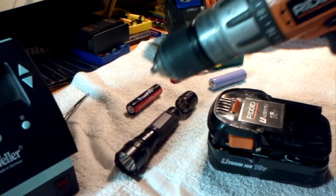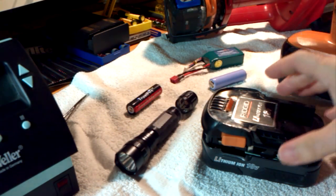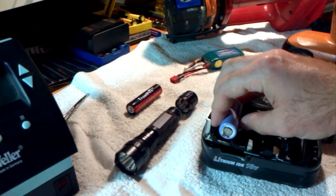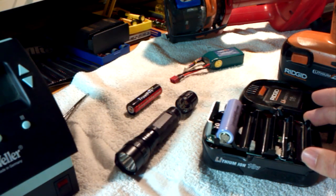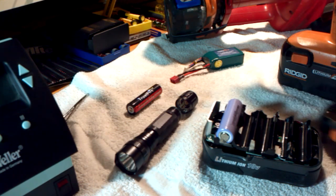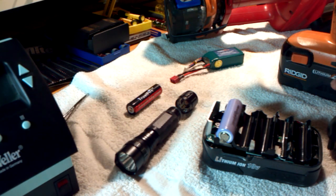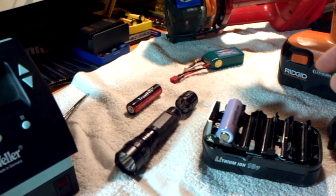This is the infamous original RIDGID drill that started this all. So this is what one looks like disassembled — here's where the cells went, and there were five of them; there are five slots here. This is a single-layer battery pack. You can get the max version where it's actually got two sets of five — five in series, and then two sets where there's another layer in parallel, so you get the same voltage but twice the amp hour rating.